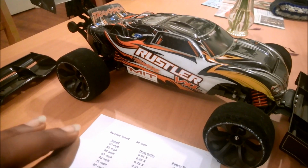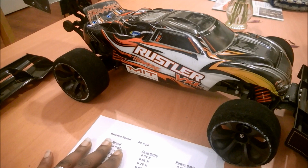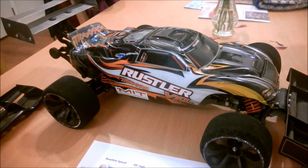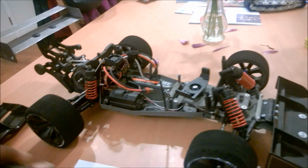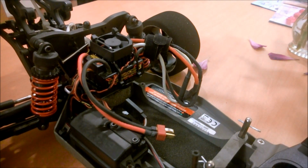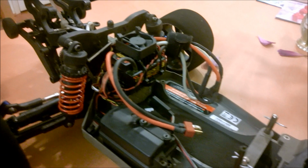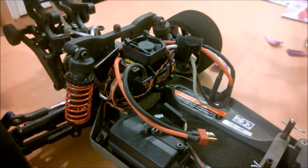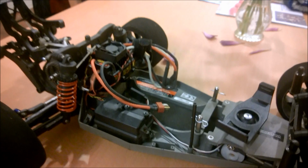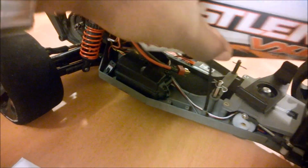No, I mean, an easy thing to do, and some of the guys like MR Tuner, he did this, and it was kind of a brilliant move on his part, and I've mentioned that to him on his channel. He has gone away from the standard ESC. So he's running a 1410 motor just like I am, but he's gone away from the Sidewinder ESC that I use, and he has a Mamba Max, or one of the various Mamba systems, which are much higher power rated ESCs. So that, I believe, is able to handle the extra current that's coming out of the SMC battery that he's getting, and that's able to get him past the limit.